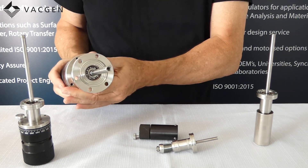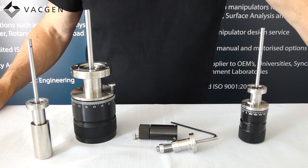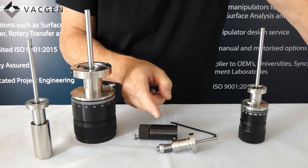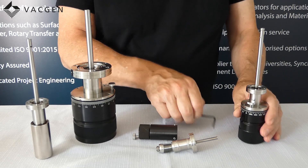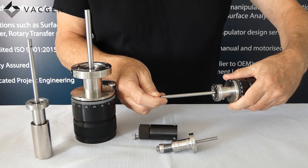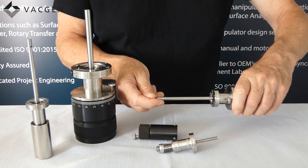The magnetic connection between the two gives you rotation. There is also another advantage: on the bellows version, the shaft is bent into the top, and if you overload it you can damage the shaft. On the magnetic version, because this is just coupled by magnets, it will actually cog over to the next set of magnets. So you physically can't overload the drive at all.